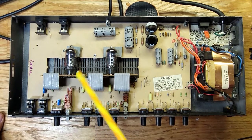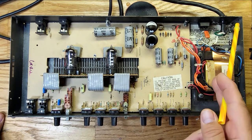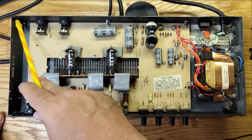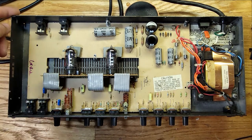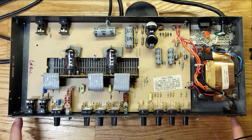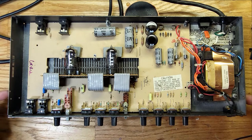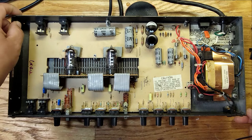So the other thing is, these screws here are also wrong. They should be like that. These actually go in here where the ears are. Okay. They're correct for this unit, but they're in the wrong place. And then they also go here and here. Okay. And then here to hold the ears in place. These are truss head, sheet metal screws.